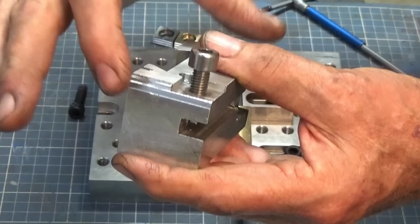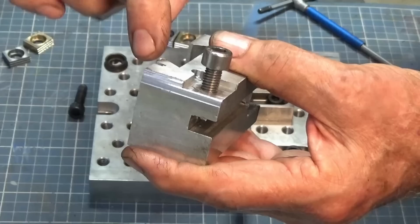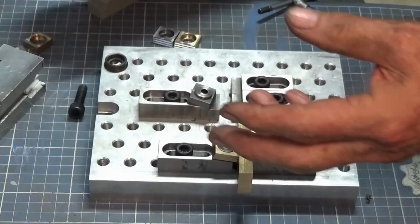And when I did this first steel part and I saw how bad it was, I went looking for the answer, and that was it. So I just nicked the corner off that with the file, and then when I put the remaining parts in there and cut them with that double angle cutter, they came out perfect. So there's a good set, and I'll show you the crook one.